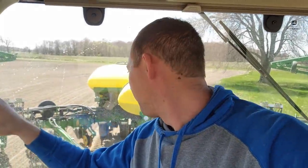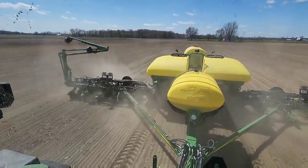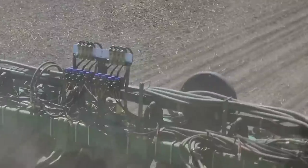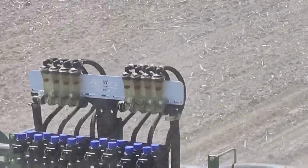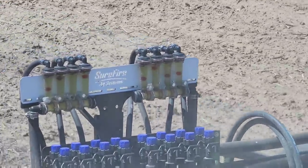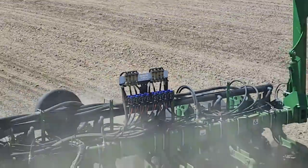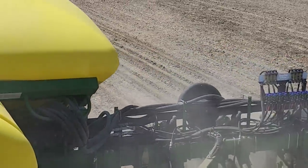Back in the field getting unfolded. Good news and bad news on our check valves - those balls we changed in the flow meters are floating beautifully right in the middle on one side, nice and even, exactly what we want to see. On the other side there's a little variation - a high one, some low ones, and I'm not sure if the third one is pegged out at the top. We'll look around for a pinched hose or something I might have missed this morning that would be causing a restriction in one of those lines.